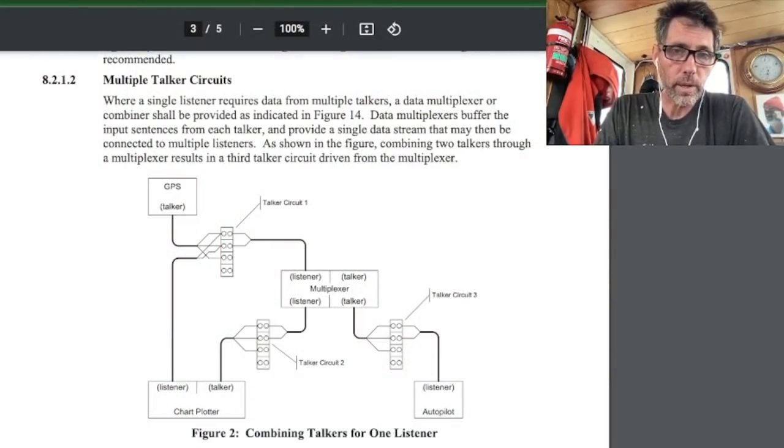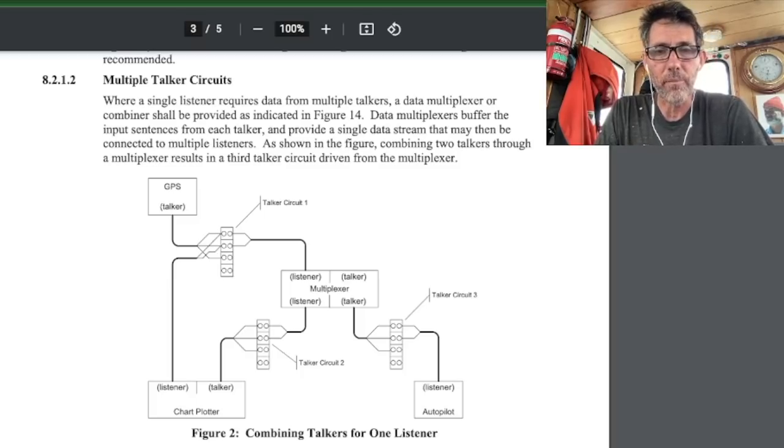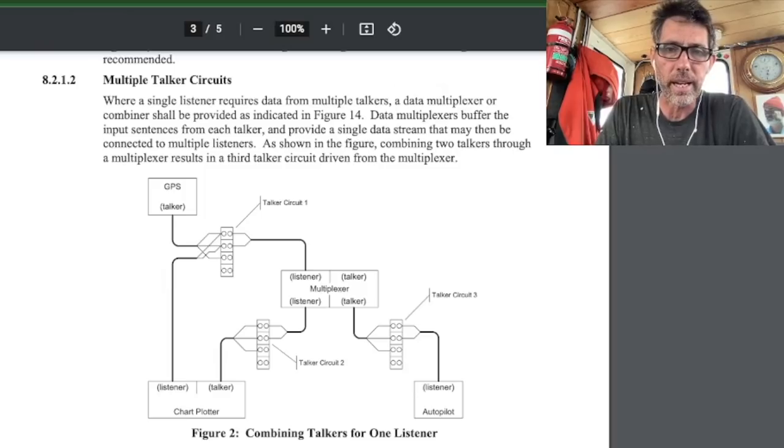They then looked at the specifics of boats and made a standard more suitable for boats than cars, but they are fundamentally the same type of network electrically. In the beginning there was the NMEA 0180, and ultimately they got to 0183, which is the first generation. That network had a big limitation: you could have a single device transmitting information and multiple devices listening. To get around that, you had to build a complex network with multiplexers, allowing multiple talkers and various listeners. It had to be custom-designed, which was error-prone, slower, and harder to do — all things improved with NMEA 2000.